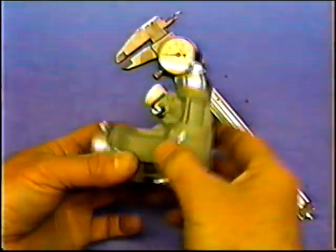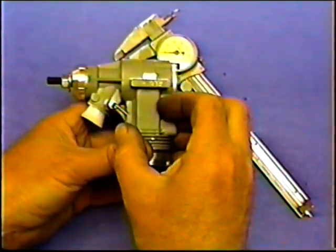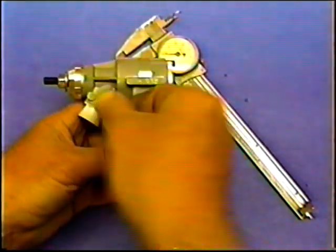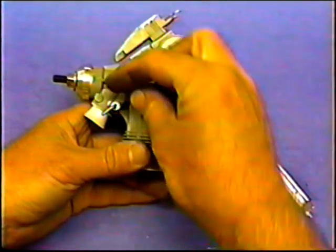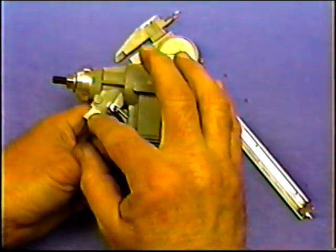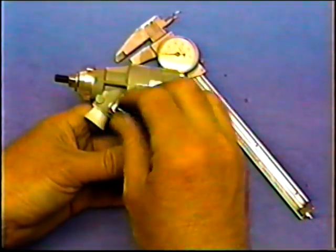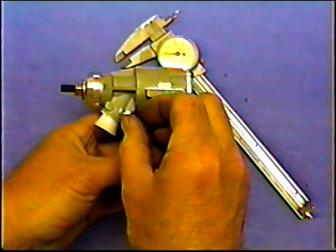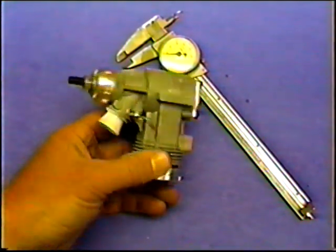What I've noticed is, on the one that we have that has the 280 spigot, our needle valve range, I'm going to back this out a little bit, is roughly from the richest setting, and I reference that off the cow line, just as a rough number, and right about there I'm bordering on going a little bit leaner than I want to run the motor. I always want to have that little hint of richness. Just as an original thought, I'm guessing that equates to a 1/4 turn of needle. And boy, this is a really nice needle valve. You can tighten or loosen a cinch nut, but having a quarter of a turn, you can infinitely adjust it. You can just touch it like that and see the difference in the reading on a tach. So it's really a nice feature of the motor.